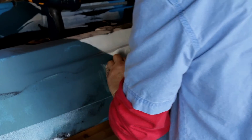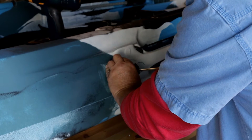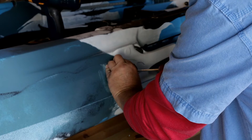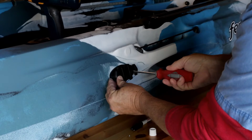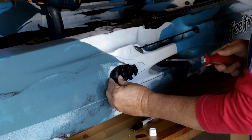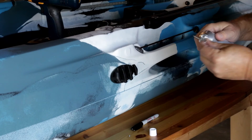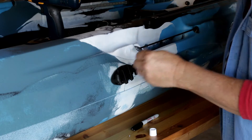These screws are a little heavier than the ones I put in for the pad eyes, so it's taking a little more effort. I didn't change the drill bit — I'm keeping the same drill bit. What you want is a bit several sizes smaller than the screw. You don't want to over-drill the hole because then you'll find yourself stripping the screw out. Go several sizes under what you really need for the screw.